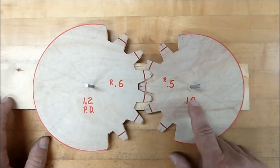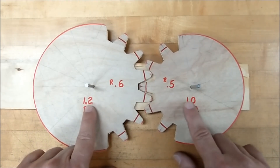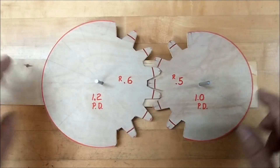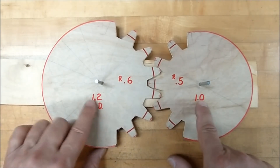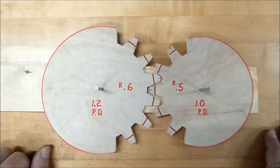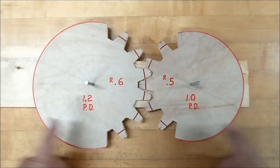You find the pitch diameter of each gear and collectively add them up and divide by half. So on this gear: 1.2 and 1.0 — could be inches, centimeters, millimeters, whatever — 1.2 plus 1.0 equals 2.2. Cut in half: 1.1 center-to-center. That's the quick note I make to myself. The halves are 0.6 and 0.5, and 1.1 center-to-center will allow these to function correctly. If unsure of your machinery, stay to the high side of 1.1 — make it bigger, not smaller. Smaller it binds; bigger it makes more noise and rattle.